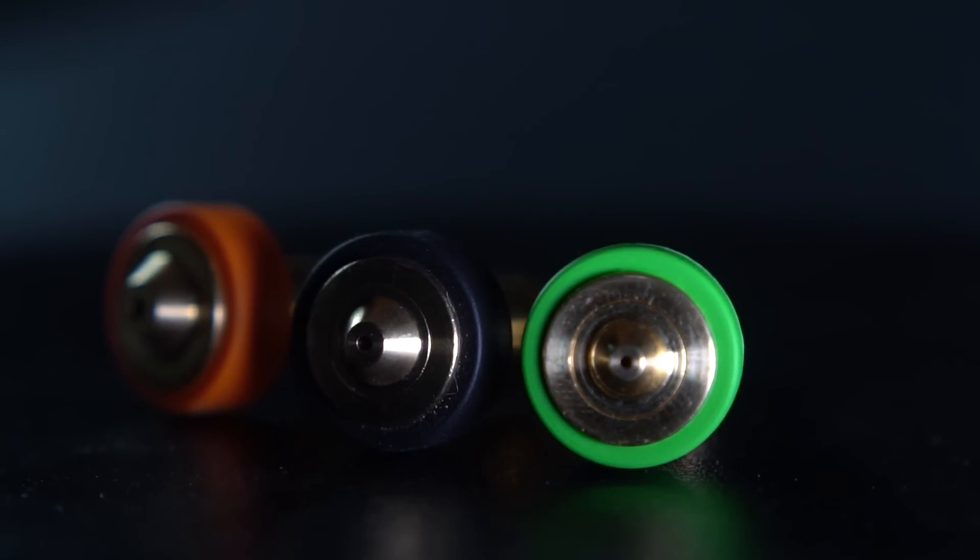Things like finding the exact way to get around it without causing problems like Basel did, or like the Chinese manufacturers of the CHT clones have done — they use a 3mm nozzle and put a slug in it that splits the nozzle into three pieces. As Stefan of CNC Kitchen found out, it actually works as good, if not better, than a regular CHT. But now that CHTs are also available in hardened materials, there become other options. If you transferred over to the Revo ecosystem, you can't use any of those nozzles because they're not compatible — that is one of the downsides of the Revo system.